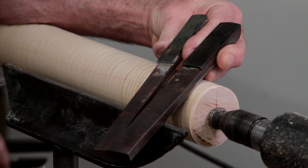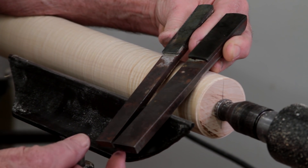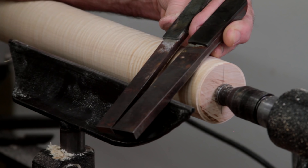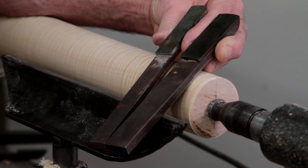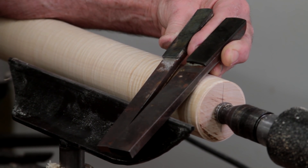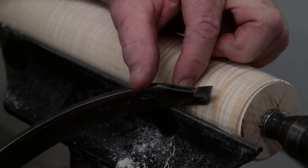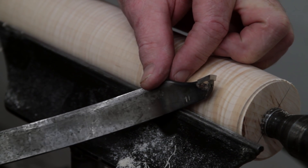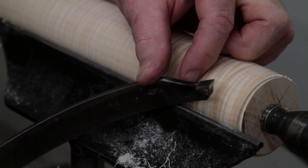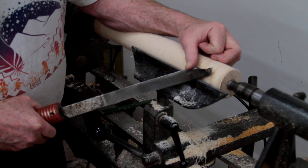This is my three-quarter inch wide Big Ugly. This one is pretty easy to get wood all the way around it when you make a handle, and I generally don't worry about cutting these down. For scraper purposes, I don't think you need anything wider than one inch. I can stall any lathe I've ever turned on with a one-inch wide scraper — anything bigger than that is just kind of overkill. This is a three-eighths inch wide piece of tantung that Randall silver soldered for me onto one of my McNaughton coring blades. This is another experiment in progress, but I love the way this cuts. If you try the JB Weld on this, it will not hold.